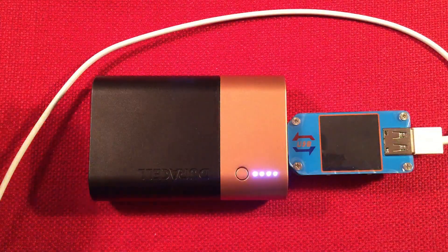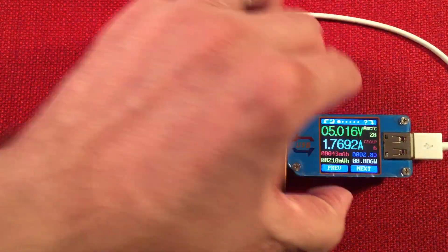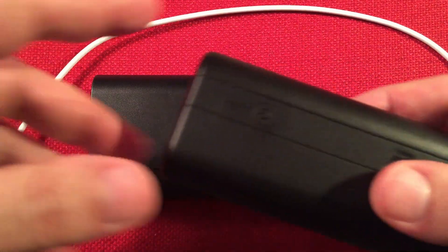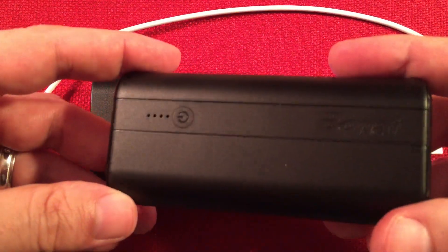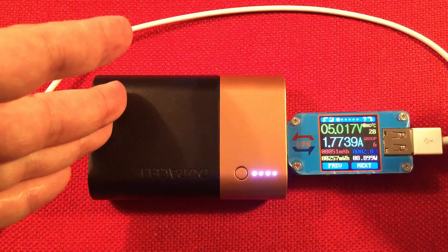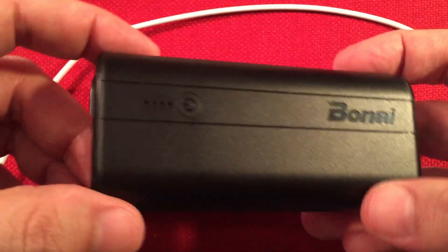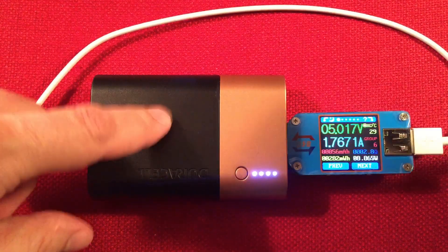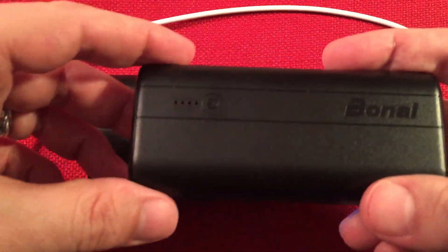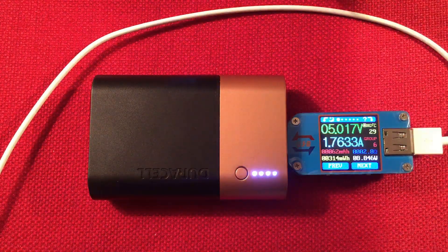What I noticed when playing around with both the Bonai and the Duracell: this little Bonai, when hooked up to the iPad, generated some RFI on FM, which I was really surprised by. I had my radio nearby and it made a bunch of noise. But the Duracell did not make any noise on FM. On medium wave it probably will make some buzzing because there's quite a bit of conversion going on. But if RFI on FM is important to you, go with the Duracell. Though typically if you're charging, you've got the radio off and you're charging for the night. They're both good values, but the difference surprised me.